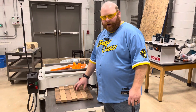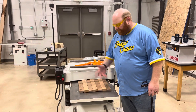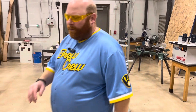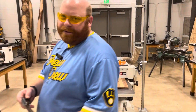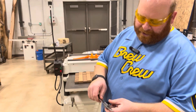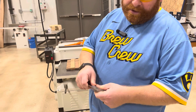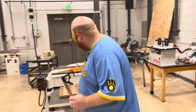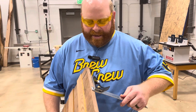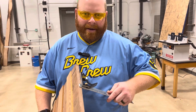I'm going to show you how this works. I have a piece of wood here that was glued together from multiple species — two species. What we're going to do is plane it down to one half of an inch. The other tool we like to use with these are our contractor or carpenter squares. We like to set the carpenter or contractor square to the height that we want — so we want this to be at one half inch. I'm going to use this to measure the edge to make sure that as I'm going I can see where I'm at. Once the wood is flush with the contractor square, I know I'm at the depth we need.